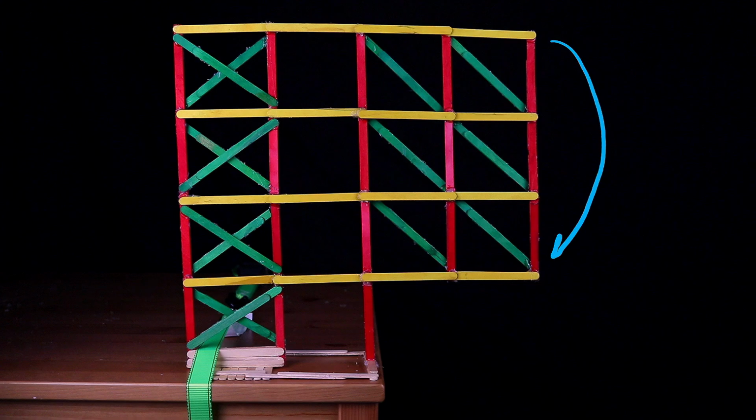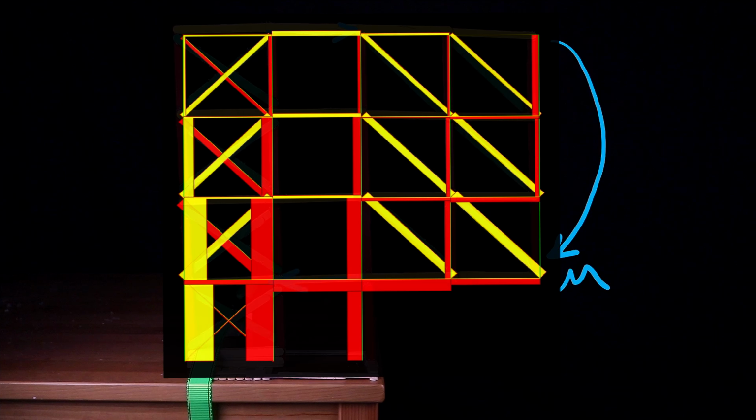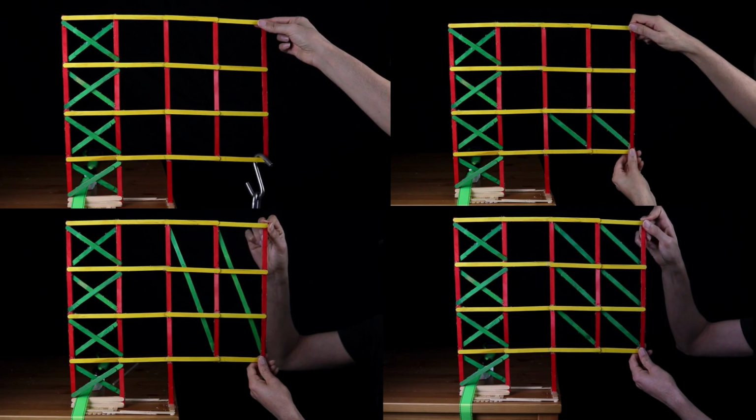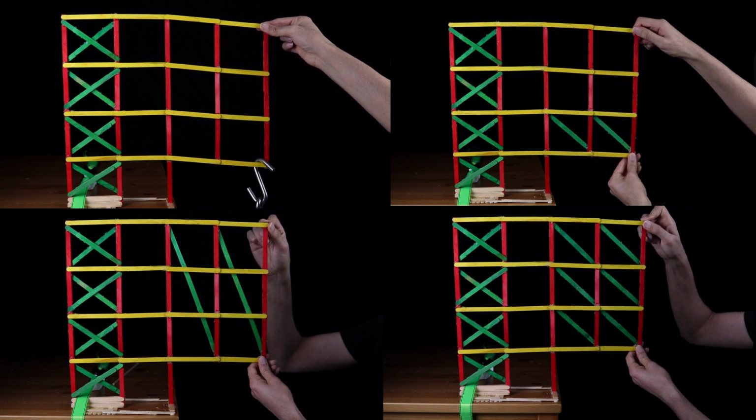As mentioned earlier, this experiment featured braces at all 3 levels and at every single cantilevered span, resulting in a high lever arm for decoupling the cantilever moment and engaging more elements at intermediate floors. Please note that there are many other ways to frame a multi-story cantilever in a building that were not covered in this video.